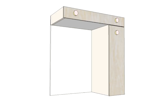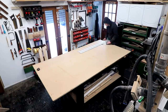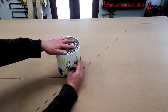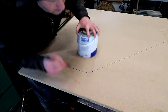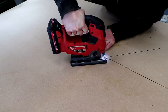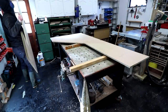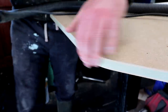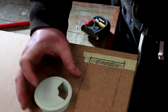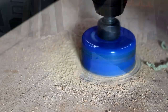I'll be adding a back panel to help support the cantilever on this component of the desk — more on that later. Now onto the third and final component: the desktop, for which I'm using 18mm Medite Smartply MR-MDF. After marking up the shape based on my original drawing dimensions, I decided to add some gentle curves by drawing around a paint can. I then made all the straight cuts with the track saw and used the jigsaw to cut the curves. I also added a grommet hole to the desktop using a 60mm hole saw bit, drilling from both sides to get a nice clean cut.